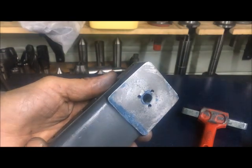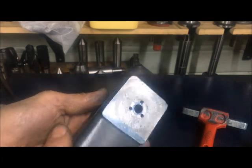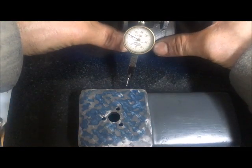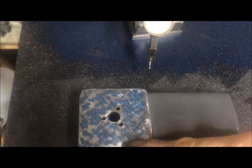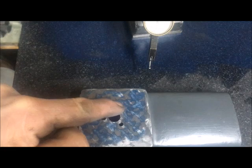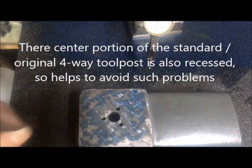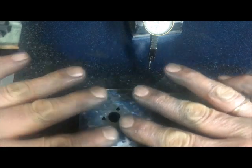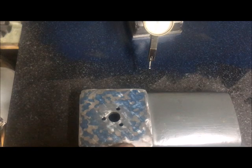I'll scrape down the high spots, and when you've gotten it reasonably flat and you're certain you are within flatness limits all over — I have an area here which doesn't bear yet — when you have an established flat surface, I would probably relieve it a little bit around here. That way I can at least delay when wear sets in and the plate on top begins to rock. So a few more strokes here, and then I'll relieve it in the middle.